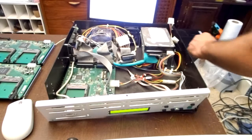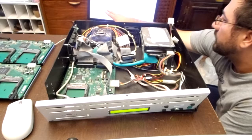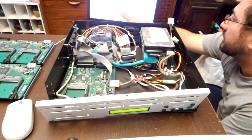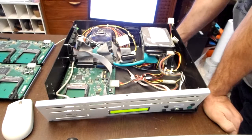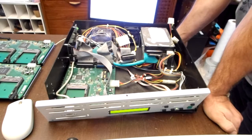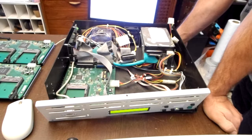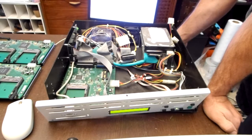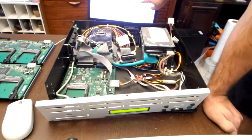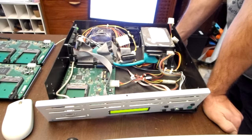So yeah. Card comes up, communication controller, Altera Corporation, unknown device, 0004, revision 01, which, when looking online, is an FPGA controller made by Altera, which is now Intel. So I don't have a whole lot of information on it. Could be a driver issue. Since it says unknown, maybe it's not being detected by SUSE Linux, and I need to figure out what configuration needs to be done on this.